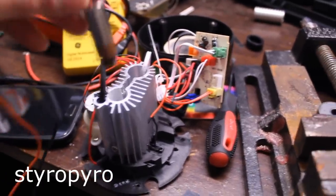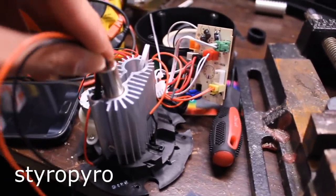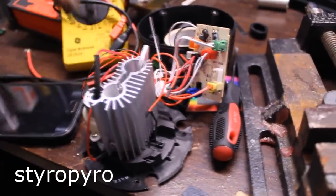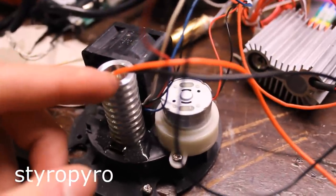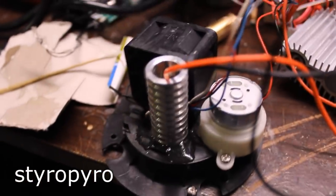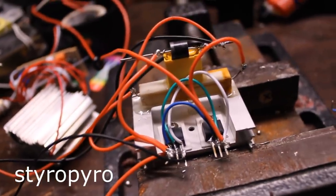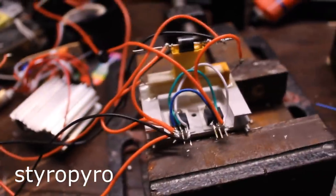It's time to stick the laser inside of this projector. This laser diode module does fit inside the heatsink of the old laser module that came with the unit, but it's a little bit loose. Considering how strong this laser diode is, it's going to overheat in just a few seconds if I don't do anything about that, so I'm going to replace the heatsink. I put it in a new heatsink and then put a fan next to it to keep it cool. I also built a laser diode driver to power up that blue laser. You can't simply hook up a laser diode directly to a power supply because you'll blow it, so I built this nice current-regulated driver.